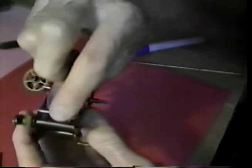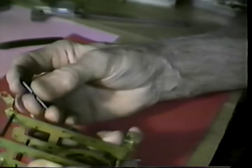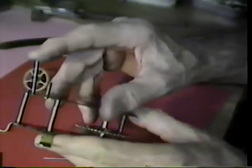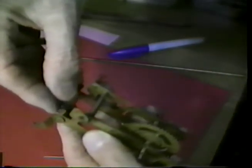If we look at the length of the arbor, we have just a little end play. If we drop this between the plates, taking a look right here, as a matter of fact, this movement is not very rigid. The frame can flex on it when it's wound. So we gave this rather liberal end play, about 10 or possibly 15 thousandths of an inch. The pivot holes, you can see how much I can carry this pivot round and round here. I can tip that pivot in that hole possibly five degrees, called a 5-degree clearance, simply for sake of a term. And that says that we will work within those holes in this plate very, very nicely.